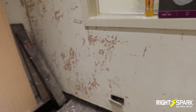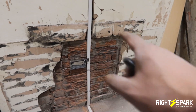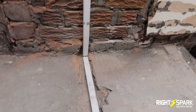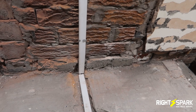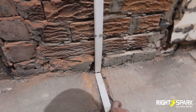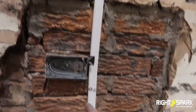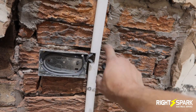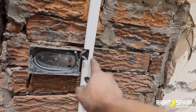I didn't want to break the wall because the consumer unit is only on the corner, so I might as well just do a new ring. These are all wired in and then I had to bring the cable in. This is what I had to do because there used to be an old fireplace here which they took out, and they wanted a socket there and another socket on top. I had to break and chase the floor - it's more than 50mm deep, so once it's all concreted it should be fine. It's quite deep; it'll be sand and cemented.